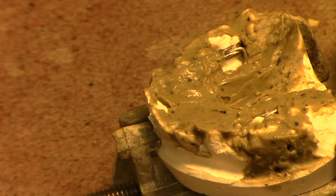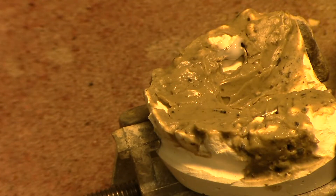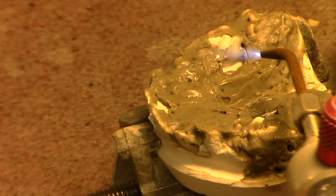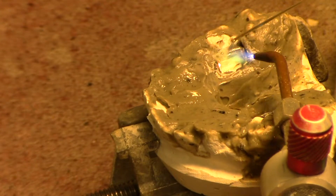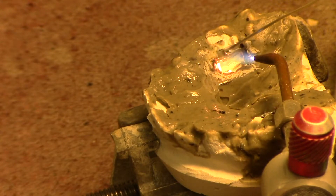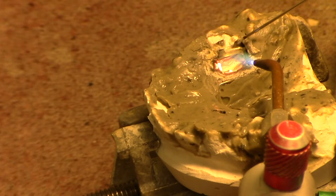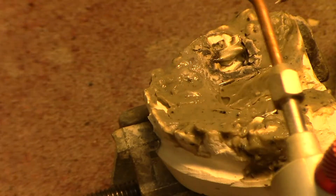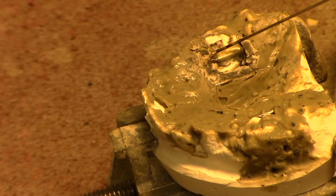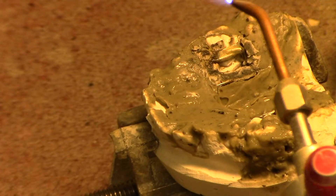I'm going to use my clean brush, heat up the joint a little bit with the flux on it, then put just a little bit of solder on after the flux melts. Now I take this probe and just move that solder around. The reason I put a little solder on the end of the probe is — if I didn't, that wire would oxidize immediately as I was using it. With a little solder on there it coats the tip and keeps oxidation from getting into the solder joint and contaminating it.